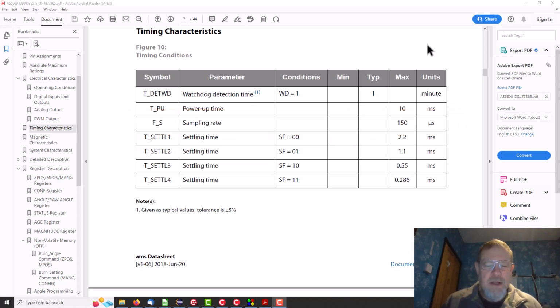So ideally we would like to take a reading out of it every time it takes a reading, but there is no way I can see that it'll tell you when we've got a reading. You see, it's an I2C interface, which is a slave interface at the chip, so it gives you its latest reading when you ask, but it has no way of telling you when it has a new reading. So I think what we have to do is we just have to take readings at a rate that suits us, and well, for now we'll just have to see what happens.